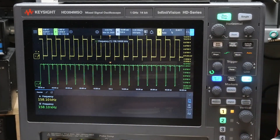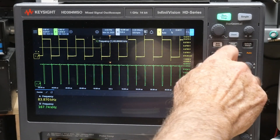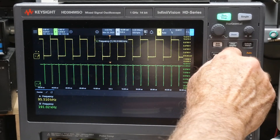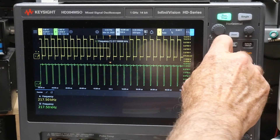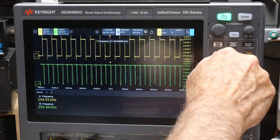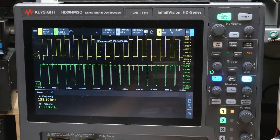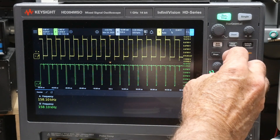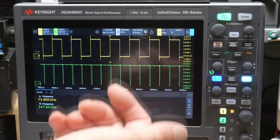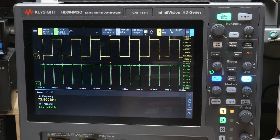It's still working at 144 kilohertz. Now it's starting to not work — you can see we're not quite working at 150. Right about 158 kilohertz is where you're no longer getting that second little spike. Now, if you needed to square this up, you could run it into a flip-flop and make it a 50% duty cycle again. But we have doubled the clock.